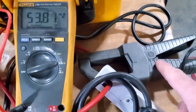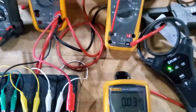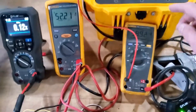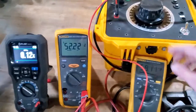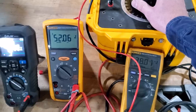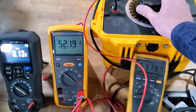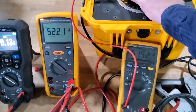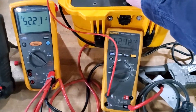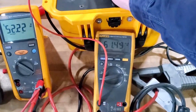Even though the FLIR is pretty accurate most of the time, especially on low ranges, it's not very accurate when you get down to around 30 milliamps of ripple — it shows absolutely zero. It only really starts to register at about 0.1 amps through the CT. So with a double wrap that's 50 milliamps, and with a triple wrap that's 33 milliamps — and it's still not very accurate at those levels.